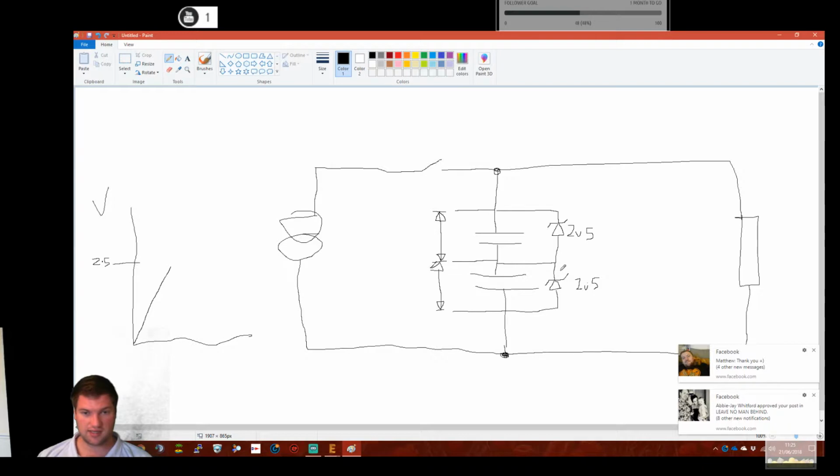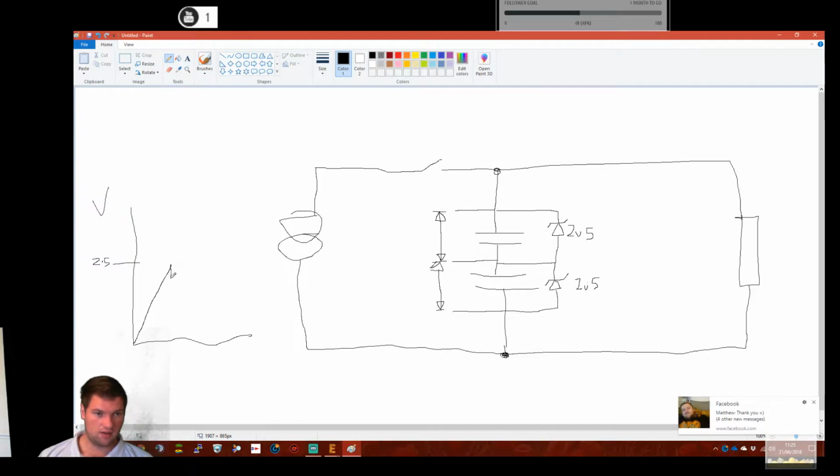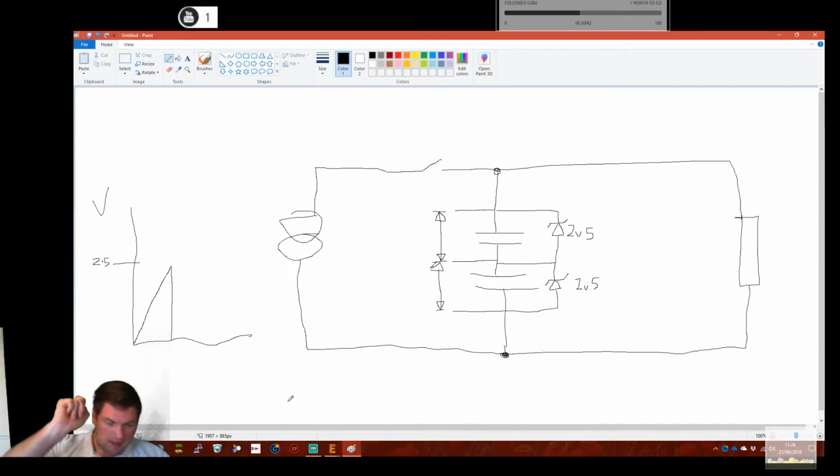So it shorts this cap out. Okay, so the voltage across the cap, if it is shorted, theoretically goes to 0. In that immediate time step, that one snippet in time, that one femtosecond, this shorts. It doesn't happen like that because it's not a solid cliff, but let's say it just makes it easier to deal with, right?